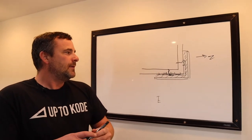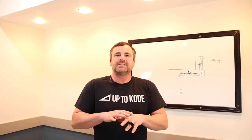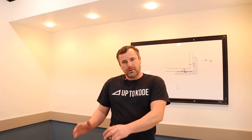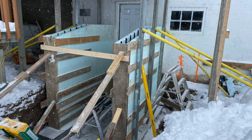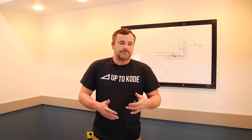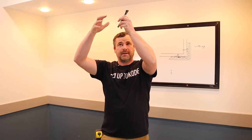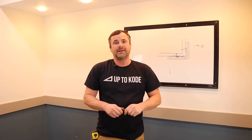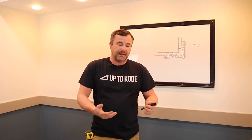If there is any frost, it's never going to separate further — it'll hold strong and true. It's all held together as best as possible. With those footings poured, we then jumped on the retaining walls. They were ICF, so relatively easy — you just stack the blocks. We did some vertical bracing and turnbuckles. It was a little tricky with the pump truck hose wrapped around under the deck, but we got the retaining walls poured.